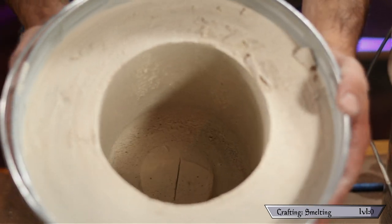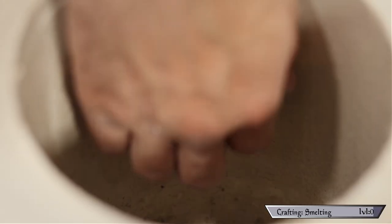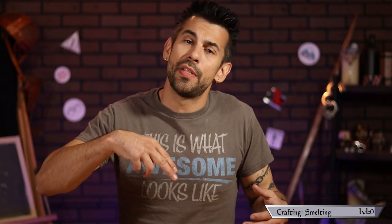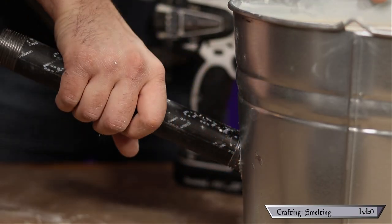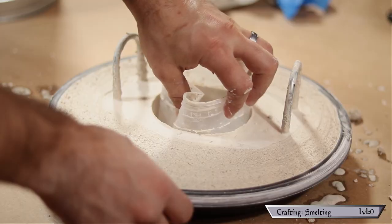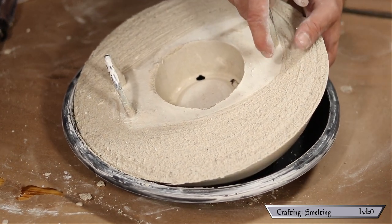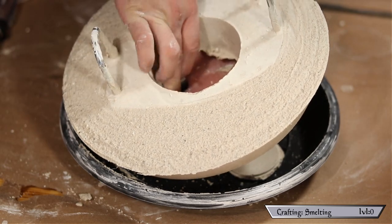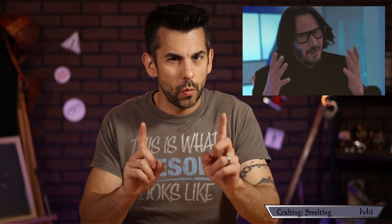While the cap set up, I went back to the body of the furnace, poured the water out of the bottle, and by squeezing the sides I was able to gently pull the bottle free, leaving a very smooth and professional-looking chamber. While the plaster mix was still soft, I used a one-and-a-quarter-inch hole saw at a 30-degree angle to make a hole to feed air through. That angle ensures that if your crucible ever fails, molten metal won't travel back up the tube. For the air supply I'm using one-inch black pipe, which threads into the hole perfectly. Back at the cap I removed the cup from the center, pulled it from its mold, and cleaned up the thin layer of leftover plaster. The refractory cement is all poured, the cap is made — but will it work? Find out in step three: smelting.